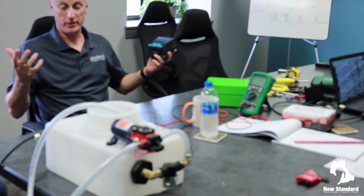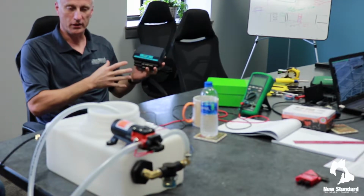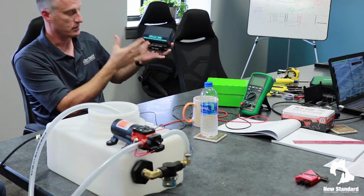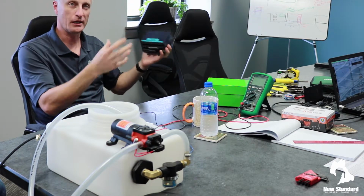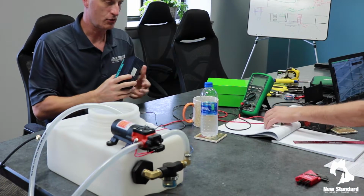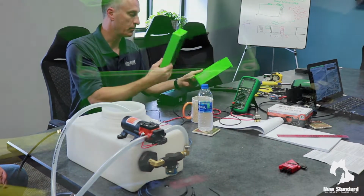The system basically will start with a component like this from Nedap. All of their components run on 24 volt. So this isn't the perfect one that would be used, but it looks exactly the same. An output would be used that drives a paint motor. The output that would be run here for whichever paint color we decide to interrupt will actually run through a box like this that we have set up.